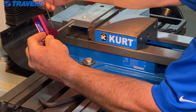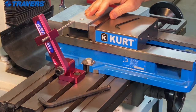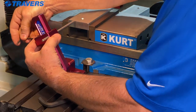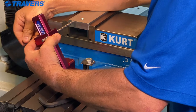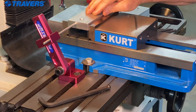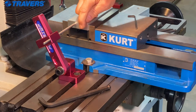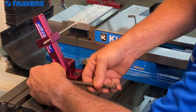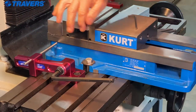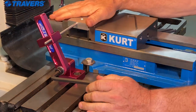This one is going to set the length of the rod. Here's my work piece up against the work stop. Now, if I need to machine this side, all I need to do is move that right out of the way, machine that side, put it right back again, and it's in exactly the same place again.